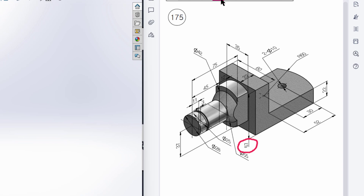After that, we need to extrude cut this portion. For extrude cutting this portion, I will draw a rectangle. Then I will dimension the distance to 22 units and dimension this lower distance to 22 units as well. Then I will extrude cut through all.